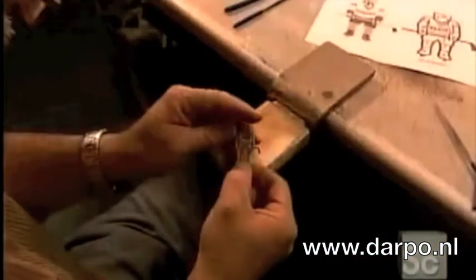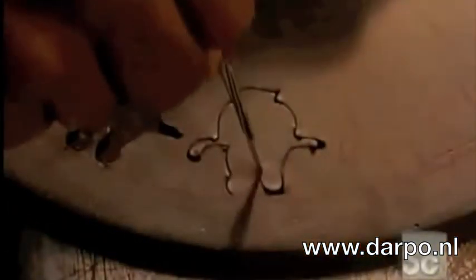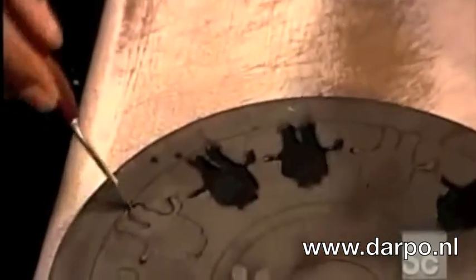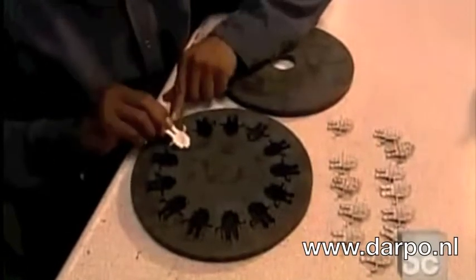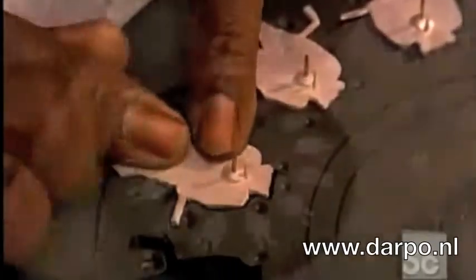Using a dispenser about the size of a sewing needle, they glue the pieces together with epoxy. It takes 5 minutes to dry. Then they cast enough copies of the master to fill up a rubber disc. After tracing the outlines, a worker uses a surgical knife to meticulously carve out the cavities. He softens the rubber with paint thinner to enable precision cuts. Then he places a copy of the master in each cavity. Another disc goes on top.